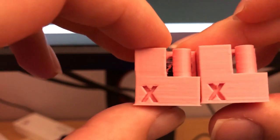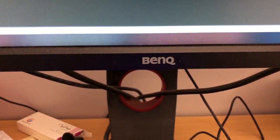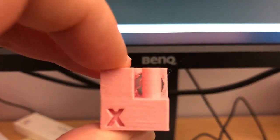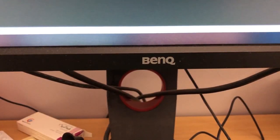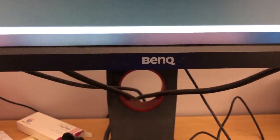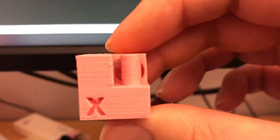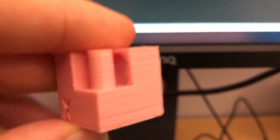This is obviously due to the longer heat zone. I tried to increase my retractions up to 0.8mm, which kind of reduced it, but there was still some stringing. I then tried reducing my temperature from 205°C down to 180°C, and as you can see after reducing the temperature it looks much better — there's only the tiniest bit of stringing, which I really don't think matters much.